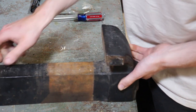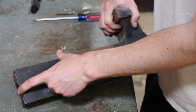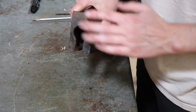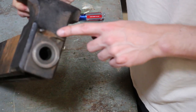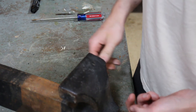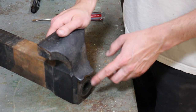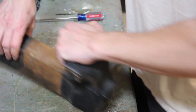There's really nothing wrong with it. It's rusty in the middle where they didn't spray paint it. It's chipped a little tiny bit on the end here. Well, actually, I don't even know that it's chipped. It could just be poor casting, because it's like that on both ends here. It's not perfectly flat. Could just be a rough casting. And this here does look broken. I don't know if it was dropped or hit or something, but it feels cracked. It's got a much finer grain structure, so it feels like a crack. And it's got some rust in it, so my guess is the whole thing was painted and then it cracked off, because it's missing paint here. So that's my guess.